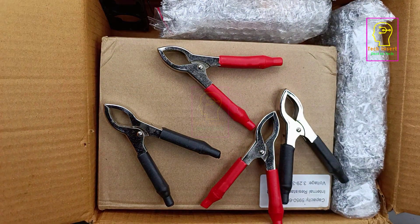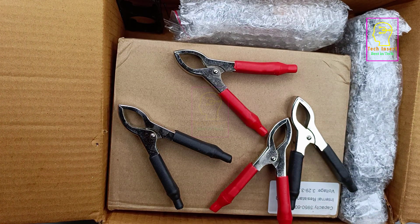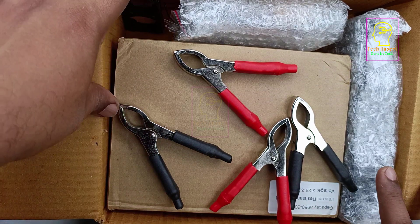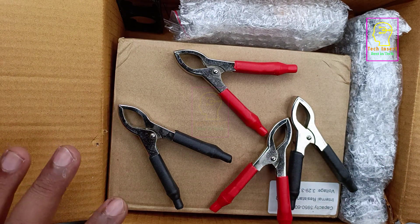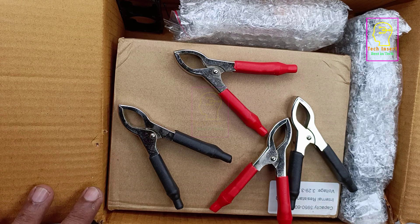When I opened the battery I realized that the real battery pack is small and the battery case was very big. So I thought we could make a bigger battery pack and insert it inside that battery box. I made that 30 ampere battery pack and tried to insert it into the existing battery box.